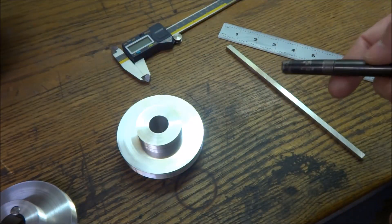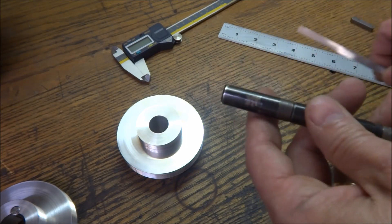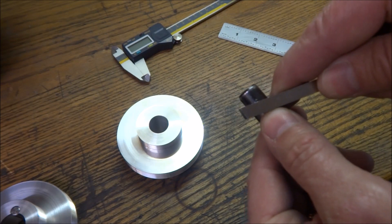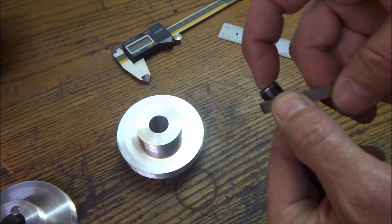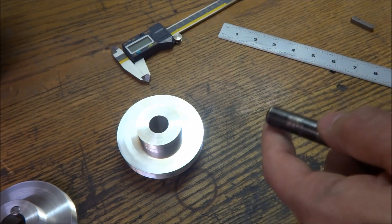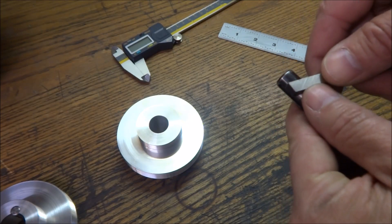So I got to looking around the internet and found a video — I'll see if I can find it again and attach the link. What he did was he took a round shaft and some square stock, put it in perpendicular at a slight angle, then cut it off. Held that in there with a set screw from the end and used that to broach the keyway — just kept pressing down, sliding over, pressing down, sliding over. So I'm going to try to combine both of those videos and do it on the CNC machine.